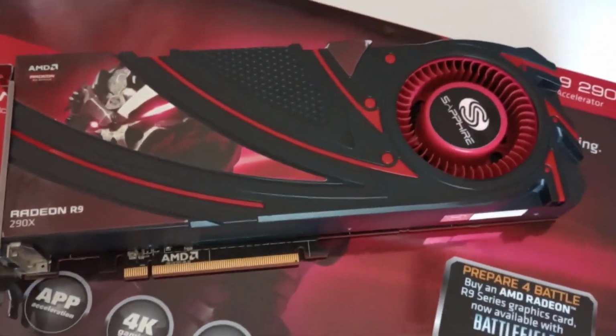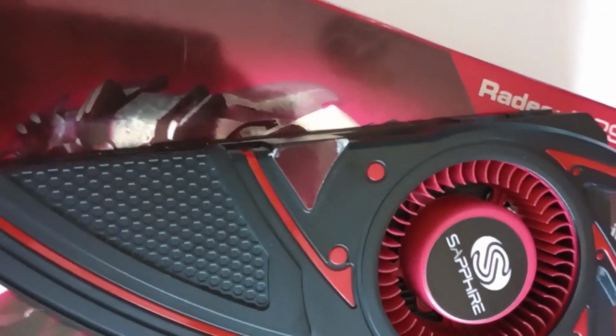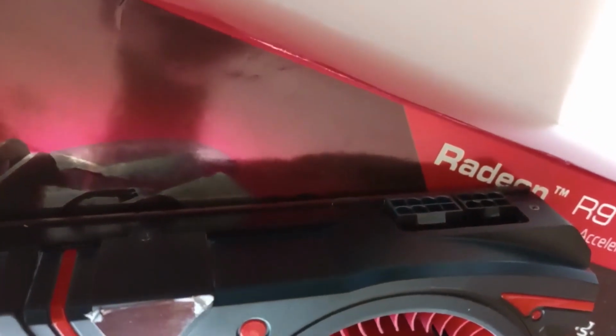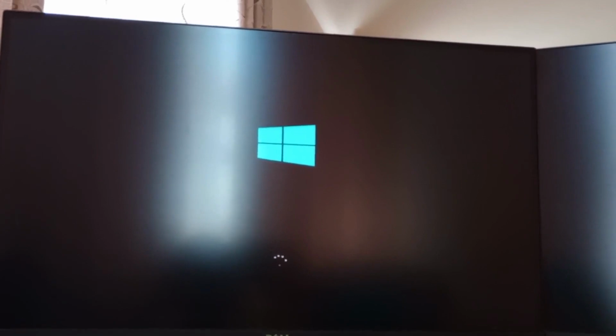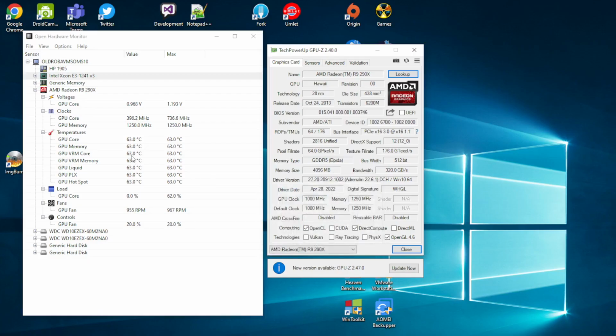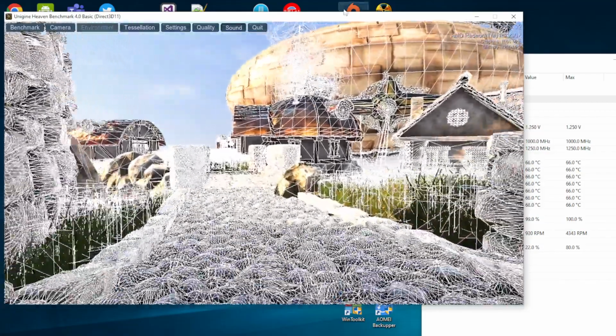Did the recap work? Did the previous owner manage to get rid of the artifacts he was getting? Yes, and well, yes. The PC booted with the card in it. The image displayed without any issues. The driver package detected the video card, GPU-Z showed the correct info. And Heaven ran fine.